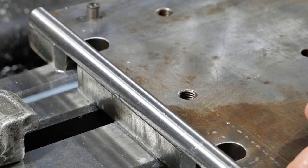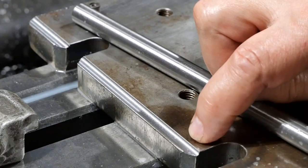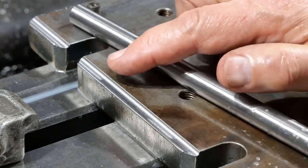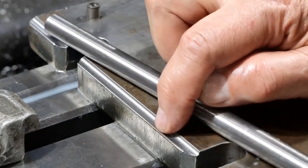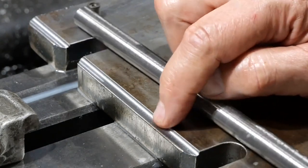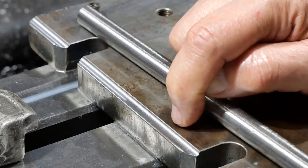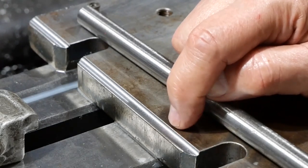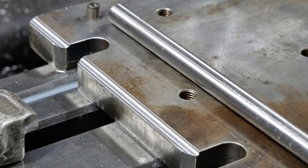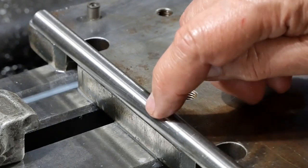If it turns out that the land on that edge side isn't enough, I can come back with a 10mm end mill 90 degrees to the surface and machine, say, a 1mm deep rebate all the way along the side there to basically get rid of this rounding off from the original deburring, and then repeat this process. And if I make the rebate 10 wide, there'll be a 1mm step down to that. It should still be enough to clear the bar. Anyway, I'll only do that if I need to. So I think the next step's going to be drill and tap to mount these sine bars.